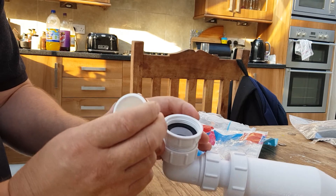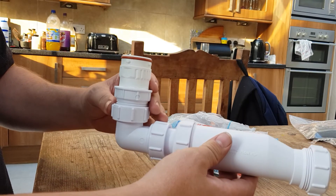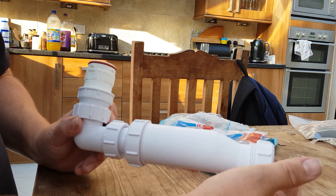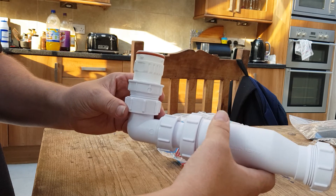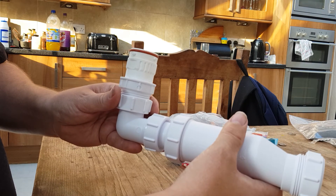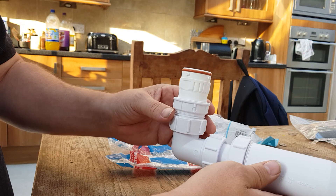Once that's in the machine, the height of this assembly is around 100mm. So there we have it — a watertight condensate assembly. From this end it'll just be 32mm push-fit or solvent weld pipe running to the nearest internal foul drain. We've also started to insulate these because in certain weather conditions the pipe can be at dew point, so we always insulate the condensate pipe now. Thanks for watching — this is how I hope to see all Zender condensate assemblies moving forward.